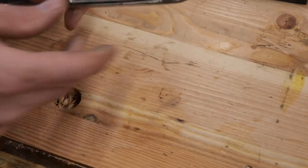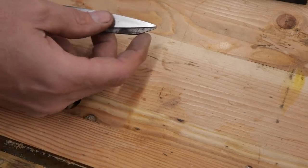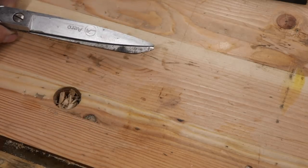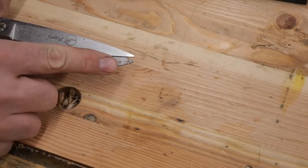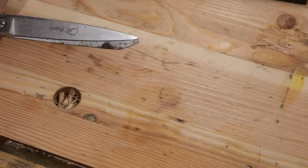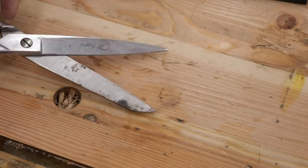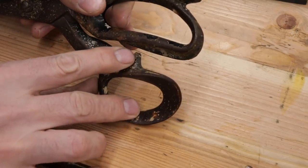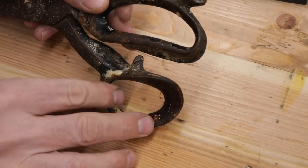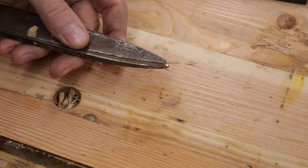The only other thing to look for if you have some that are very worn is check out the tip. If it's not closing together — if it's been worn down or ground down to the point where you can see a gap, like a gun sight type of deal in there — this can be fixed. They'll usually have a little stop on them, more pronounced on these big ones. That stop can be filed down with a file and it will cause them to over-close, actually causing them to close more.